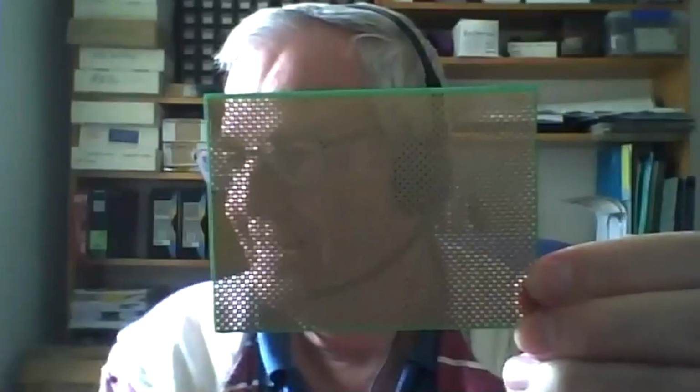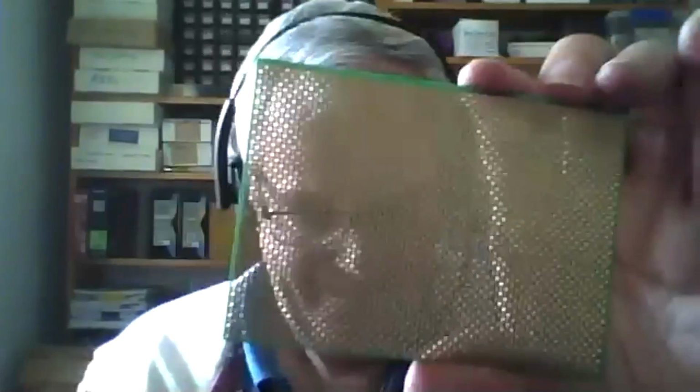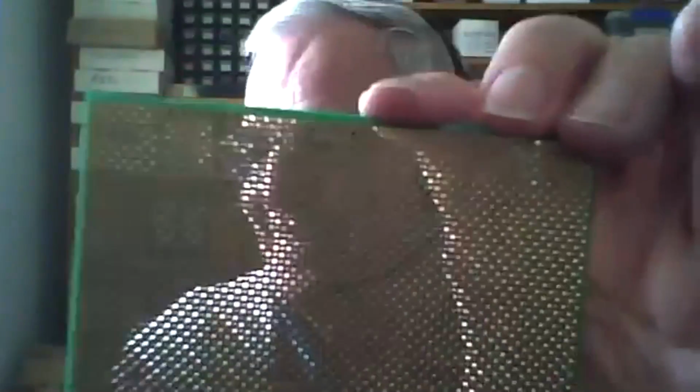Ray, did you show a board that he made that had holes on 50 thou centers? Did I see you waving something like that around? Do you mean this one here? Yeah. So that has 50 thou holes. That's a board Peter made and he's selling. But they're not on 50 thou centers, are they? That's not the pitch. Yep, they're 50 thou centers. Oh, but are they staggered? It's very interesting. Every 0.1 pitch hole is slightly bigger, so you can plug a standard 0.1 header in.